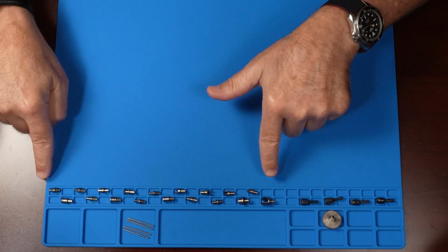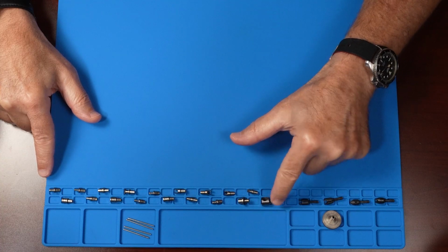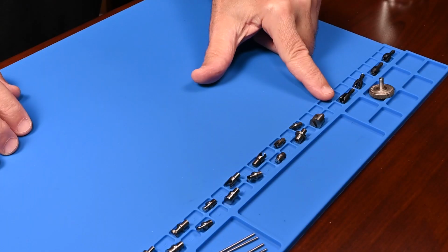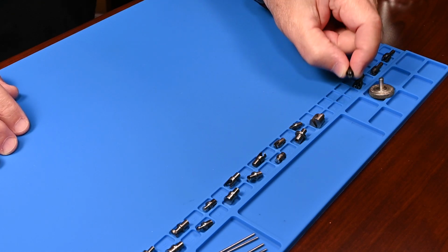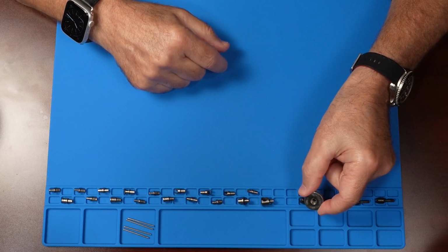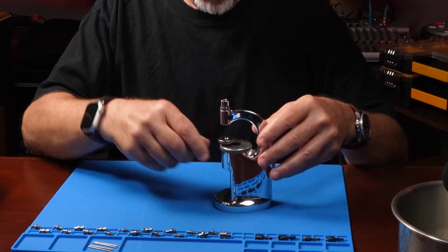I have 18 various stumps and specialty stumps. Like I think this one is a roller table remover. Plus I have a series of 5 specialized roller table clamps. I guess you'd use this to remove a roller table, that then fit into this screw down holder, which sits on the staking tool.